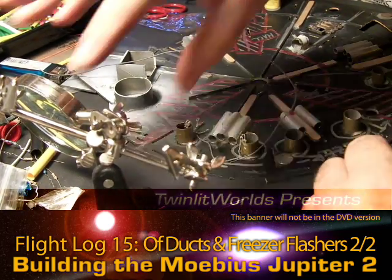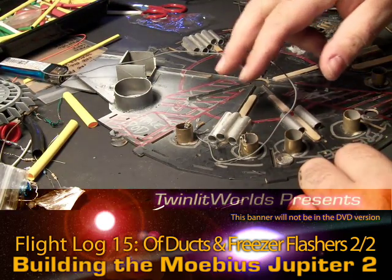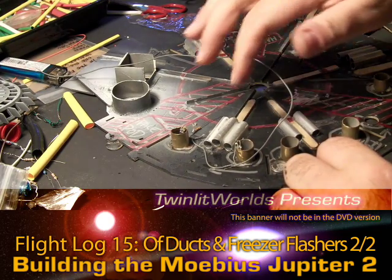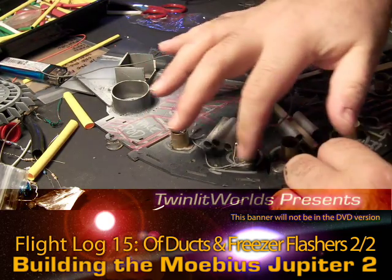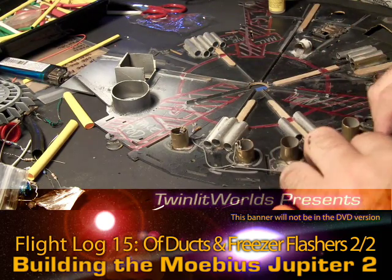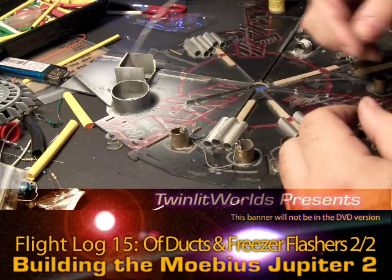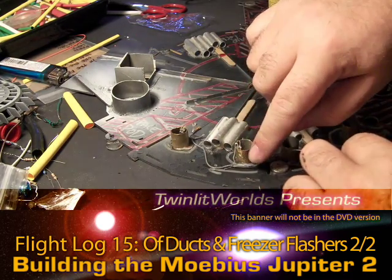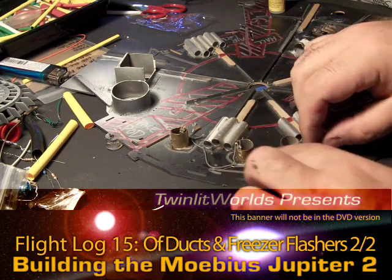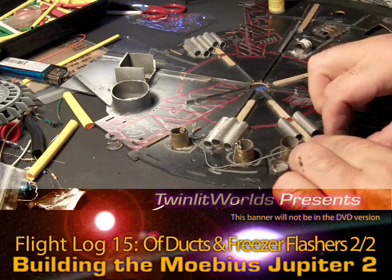Alright, so this is a process I should definitely get. I'm wiring the RGB flashers into each of the tubes here, and to minimize the wiring, I'm running all the power along the same line. There's a little bit of a trick to that, because this is solidly insulated all throughout, but in here, for example, I cut a little notch so that I could run that, give it a good wrap around the leg of the LED.